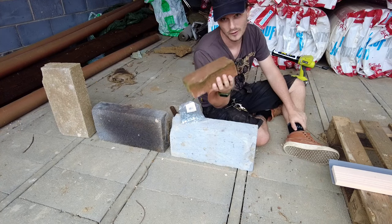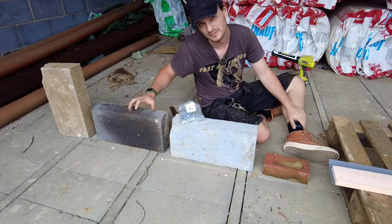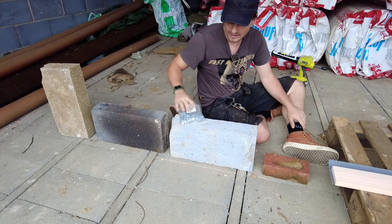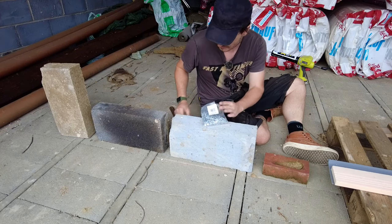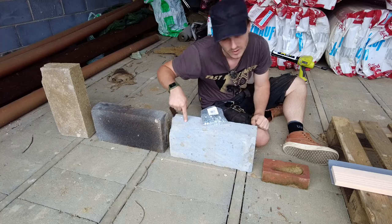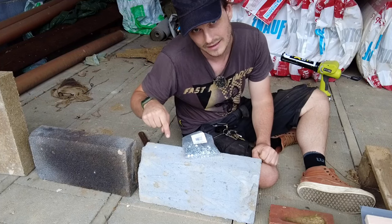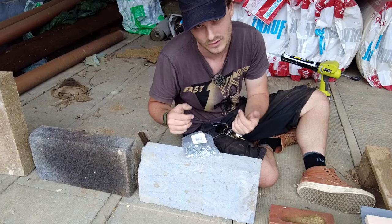Your outer skin is normally made of either brick or this, which is like a medium density block. This is a high density - you might have something like that. This is the aerated block and that's normally the inner skin. Clout nails won't go in brick, they will go in this, they can go in this but they won't stay tight, and they won't go in that. So that's the reason why you always put the clout nails on the inside, and you can use just the clout nails on their own or do the adhesive as well.